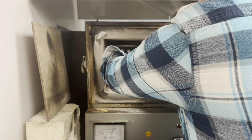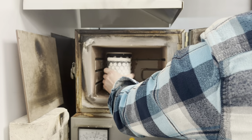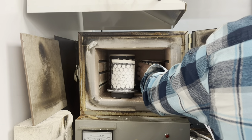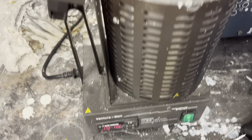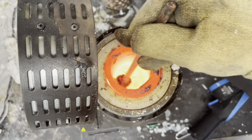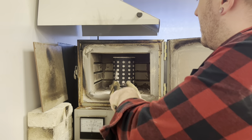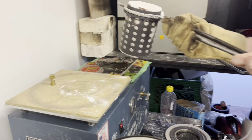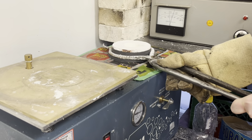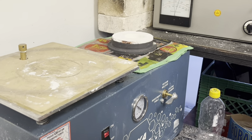You may wonder why create a hollow sculpture at all if having a core is such a difficult thing to maintain. Hollowing primarily helps mitigate shrinkage and casting defects from pouring such a hot solid amount of metal. Of course it also drops the overall weight, which means it costs less for the client. The overall weight drop may also be a good thing for the client depending on the end use case. It makes managing the melt easier because as a jewelry studio we are not at a foundry scale and we can't do more than two kilograms of bronze at any given time.